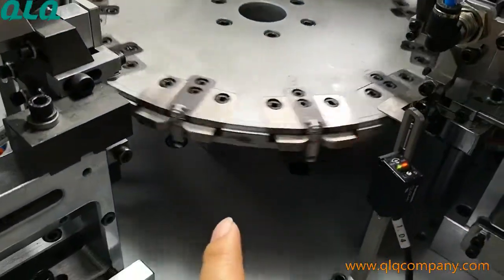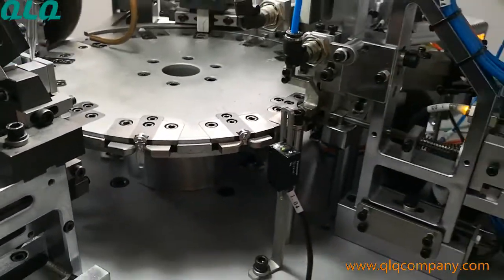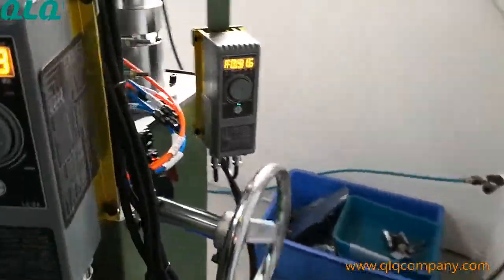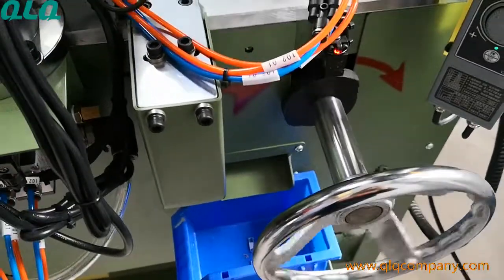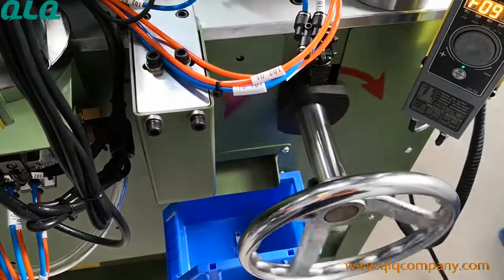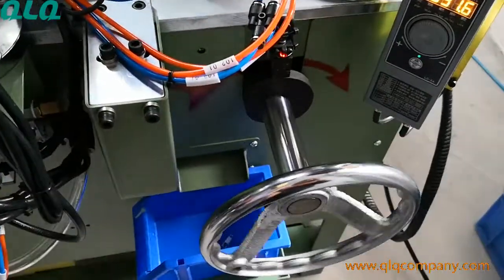You can see here the puller has been installed to the slider body already. Look at that one without the puller. Our machine has the function to inspect whether the slider has been connected very well or not. If it hasn't been connected well, it will come out from here.